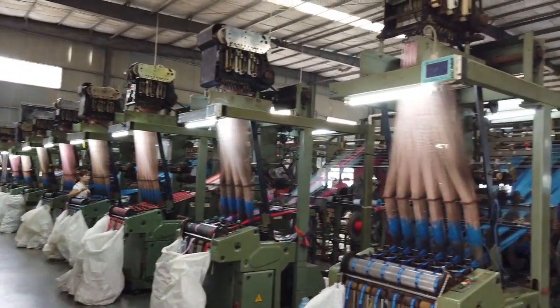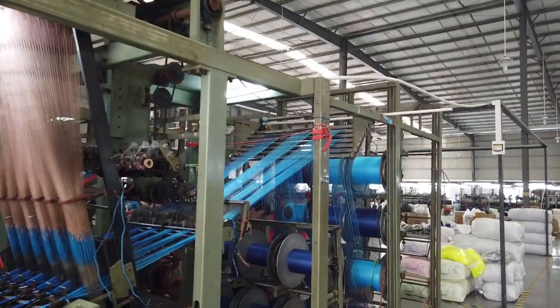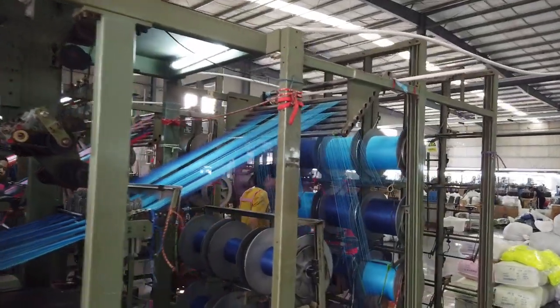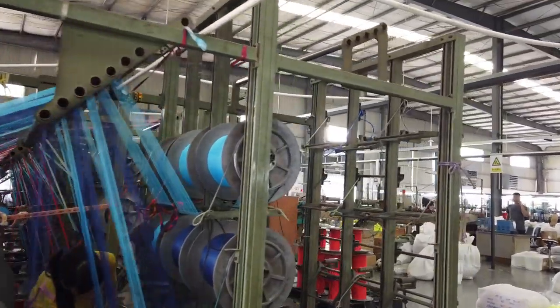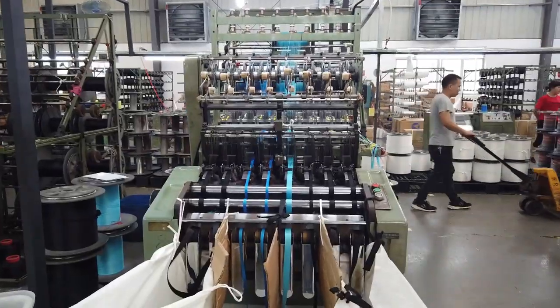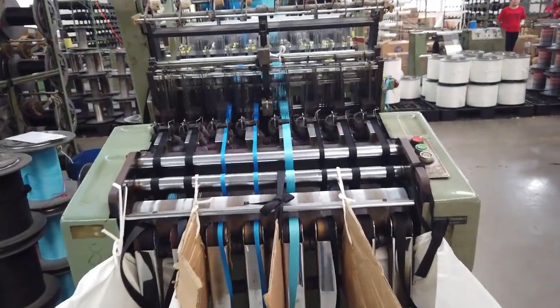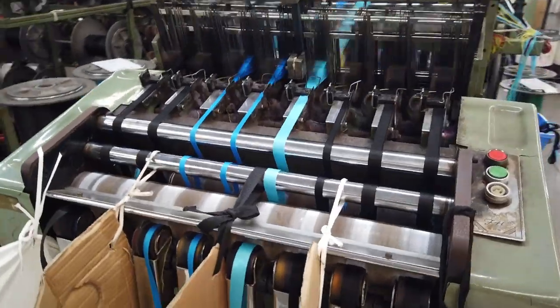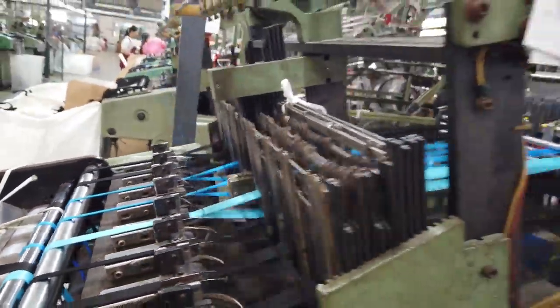This is a lanyard twilling machine, which makes only the blank lanyard material. There are over 300 threads that can feed into this machine and make up to 8 lanyards at a time, and in different colors. It takes 3 to 4 hours to set this machine up, but when they do a changeover, they have a clever trick. They stop the machine and tie the new colored thread to the old one and turn it back on. This significantly cuts into the setup time.